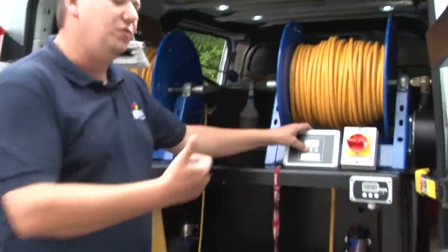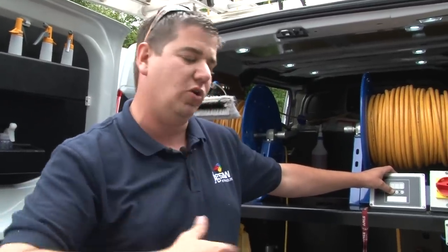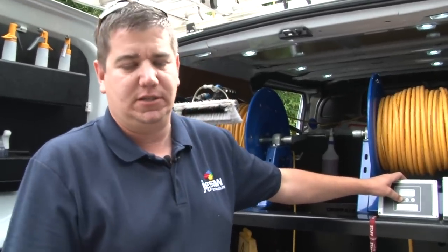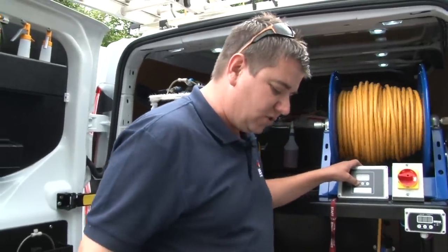So that's me with my finger down. If you can imagine a remote — we've set the remote off, an old lady comes across. It's instantly — the voltage or the spike of amps has gone up. It's trying to pull the hose and then it hits a limit. So it knows straight away something's snagged, so it stops. It really is quick and easy.